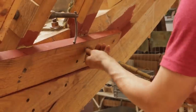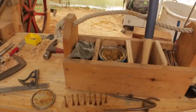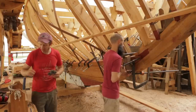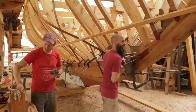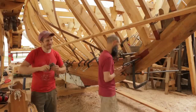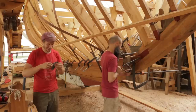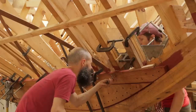In the previous videos folks thought we were putting screws into the planks without lubricating them — please let us reassure you that is not the case and we would never skip such a step. We've got the screws over here, the spot for the lube, and a copper hammer. We are going to get so much flack for doing this by hand, but there's nothing better than a brace. Sure, it'd be so much faster if we used an impact gun on a silicone bronze flathead — if you want to buy about twice as many as you have, never take them back out, and not feel what you're doing.